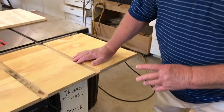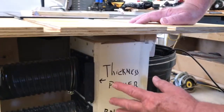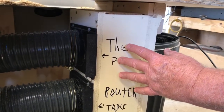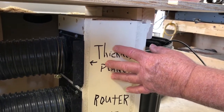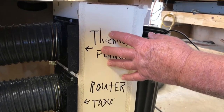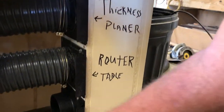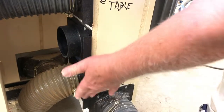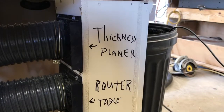Here's what we got right here. I built this plenum box. The plenum box is about eight or ten inches deep, just wide enough to fit these hoses in here, and inside is melamine — outside is melamine too, but I painted it to match the rest. Each one has a blast gate: this one is for future use, this one is my table saw, this one is from a router, and this one is my thickness planer. I got one hose now, and I don't have to worry about tripping over it. It goes to the dust collector.